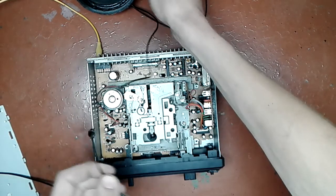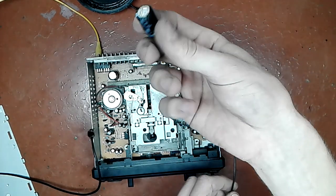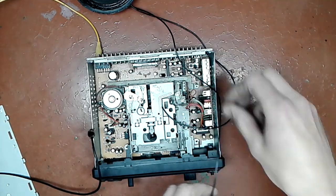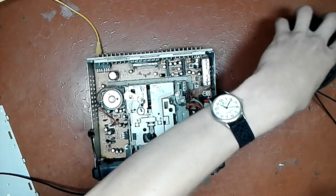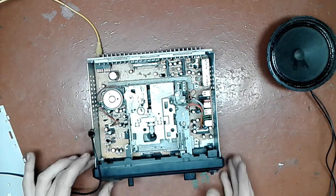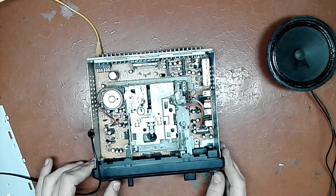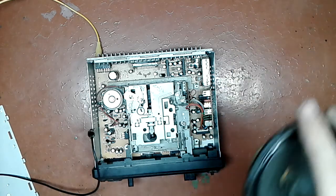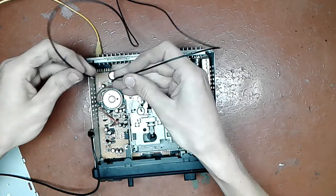Extreme movement, because there is large DC offset, which is not removed by the capacitor for the simple reason it is a bridge amplifier. So, I'm gonna crank up the volume so you can hear the static nice and loud. Let me do that. Oh, it maxes out at 15 and it was at 10. Now it's probably yelling. We will see.